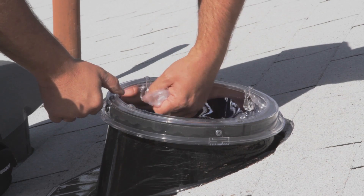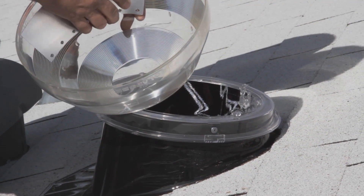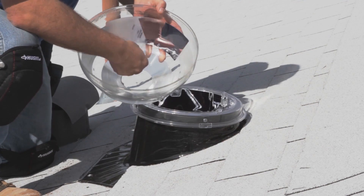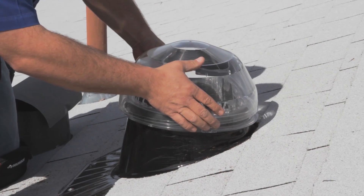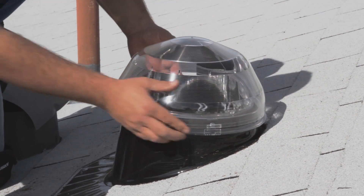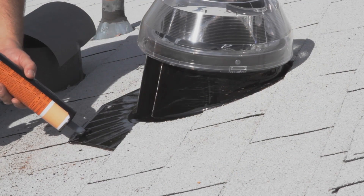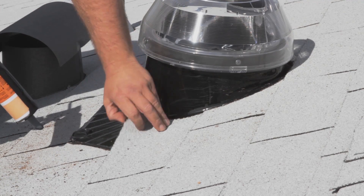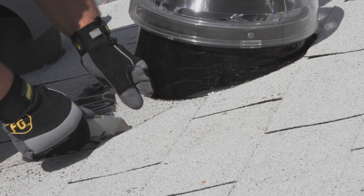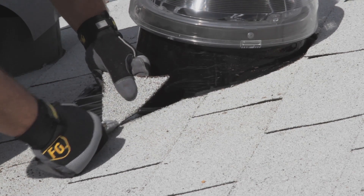Remove the protective liner from the tube interior. Using a standard or digital compass, determine which direction is south. Attach the light tracker reflector to the fastening clips located inside the dome and remove the protective liner. Rotate the dome so that the light tracker reflector faces south, then snap it into place on top of the dome ring. If you're installing in the southern hemisphere, face the light tracker reflector to the north. Apply sealant over the screws to prevent rusting and on the underside of the shingles that were pried up earlier to re-secure them to the roof. Finally, trim the shingles on either side of the dome at a downward angle to allow water to flow down the roof and prevent pooling.